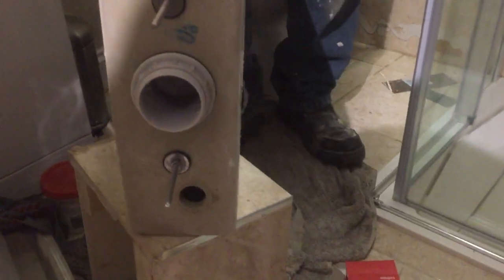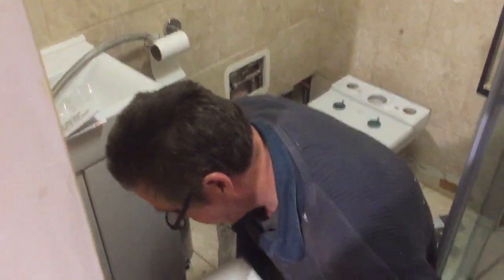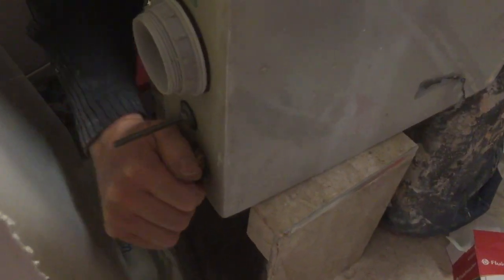At the bottom of your toilet there's a hole — the valve goes on the inside and passes through. There's not a lot of light in there, but basically it goes through at the bottom and that's it. It doesn't come supplied with a washer, so I'm using the old one. The thread comes out and you literally just tighten it up. The washer went on the inside — it's a cone shape that fills the hole.